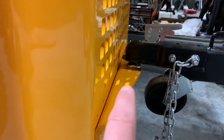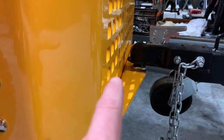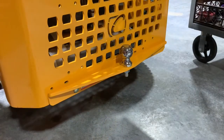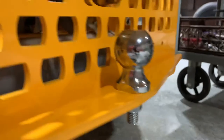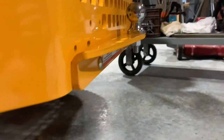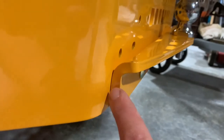The shank on this is much smaller than what you would have for a typical bumper pull or a receiver bar. Thanks for watching — like, subscribe, take care. And there's a view without the log splitter on it — you can see how small that shank is. I did not have to drill this hole out. This shank, I believe, is 5/8 inch and the hole is the same size. By flipping that guy over, we gain the space to do it. Because when it's this way, you have essentially this bar — and particularly the bolt head in the center — in the way. But with it flipped over, you get the clearance that you need.